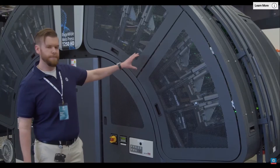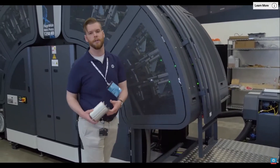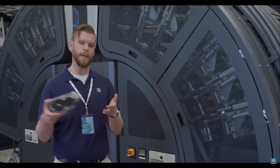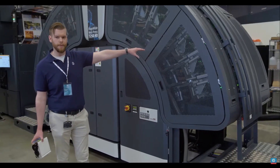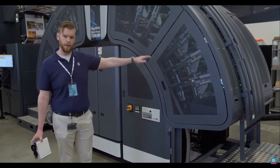The other big advantages of our thermal technology are no purge ink. Competitive devices have to purge ink to have a good looking print. Here at HP, we use a web wipe cassette. When we're done printing, we wipe off any excess ink from overspray to make sure the nozzles don't get clogged, then they cap. This press is sitting here with capped heads, but it's ready to print. When I go to print, they're just going to lower into position and go ahead and print.